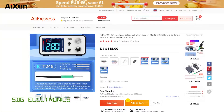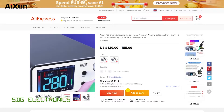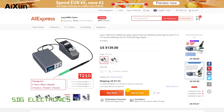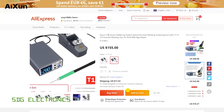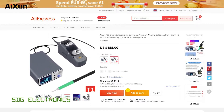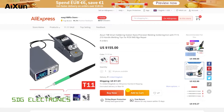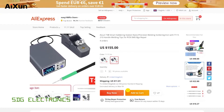When I was looking around, I also noticed they've released the T3B, which is a very slightly different version of the station itself. There are two versions available: one for the T210 handpiece, which is a slightly smaller one than the T245, and they've also got one for the micro cartridges, the T115. What you'll notice on the illustration is the connector at the front has now gone, there seems to be some kind of power button, and all of the connection to the handpiece cradle is through one lead at the back. And then the handpiece actually plugs into the back. It does mean that you will have to buy a different station if you want to use the T115 or the T210 handpieces.